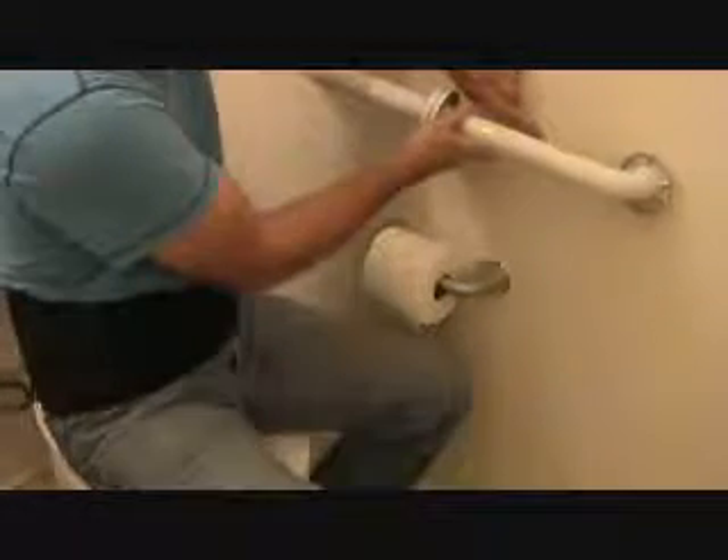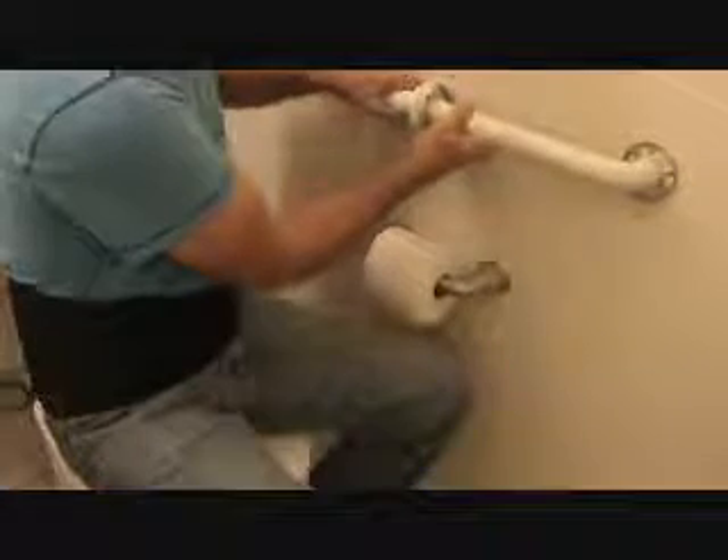Residential, you don't have to do that. Let's just see what 33 is — let's visualize that point. I've got 33 and a half right there. That's where they would put it in a commercial application: right there, 24 inches in front of the toilet.